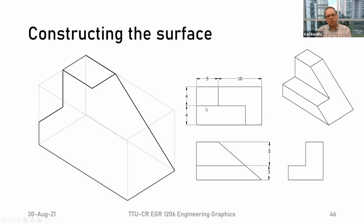So we've known all those parts. We also now know a couple more things, right? Basically, we know where this line has to be. If we go here at this edge, this edge, we know these two are parallel. They're flat here, so I can't see them. They're overlapping, right? So that means they have to be parallel in my drawing. So I can do a thinner line, a construction line, that goes from this corner and is parallel to this one, all the way down. Okay, so I kind of know where this line is. I just don't know where it ends.